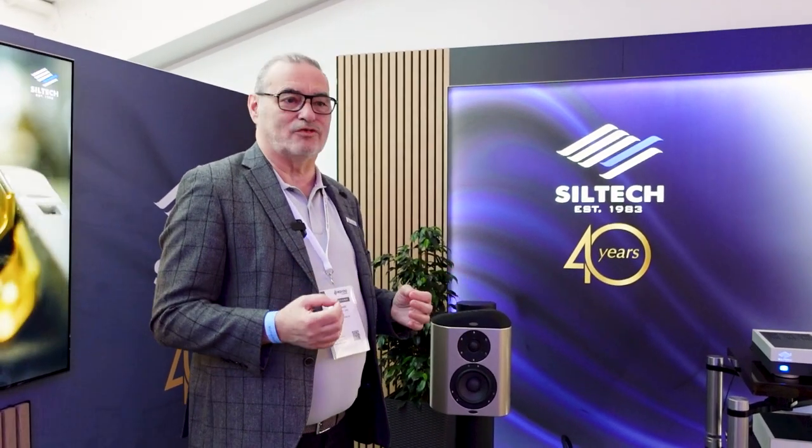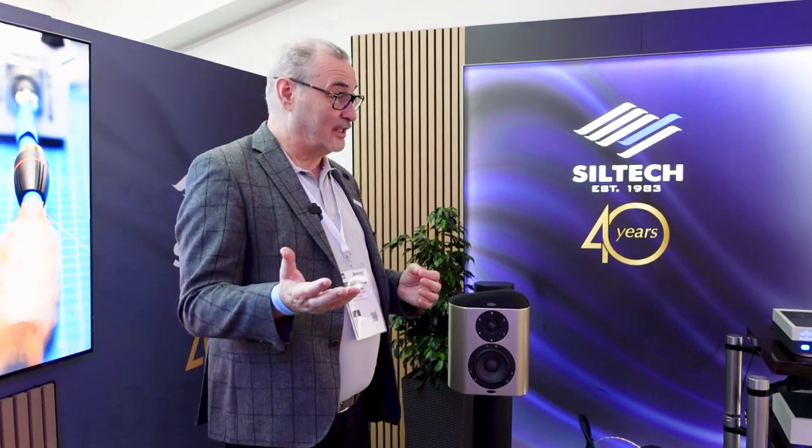We have a balanced passive filter, then a buffer amplifier that isolates the filter from the driver. It will perform much more consistently during playing and also after playing loud or soft. The nice thing is, with this speaker at home, even at low levels you get a very full response, while most passive loudspeakers need you to crank up the volume a bit to get a good sound.